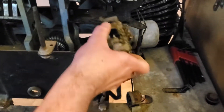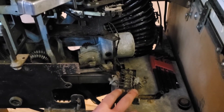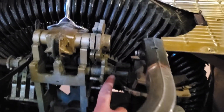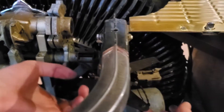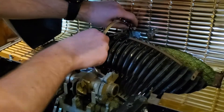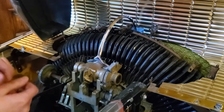This piece fits in that rusted metal piece and spins around — I'll see if I can get it off. The newest part I'm going to take off is this whole assembly right here: the tone arm with the needle on it. It looks like it fits onto this gear, so if I take out these bolts and this metal piece, the whole assembly should come out and I can clean it. This arm is all solid — it doesn't even move at all. This gripper arm would grab the record, the motor would spin, and it would flip it to whatever side — A or B.